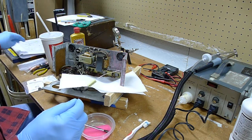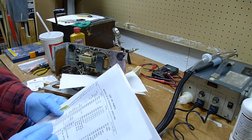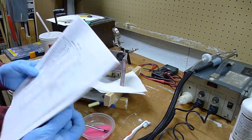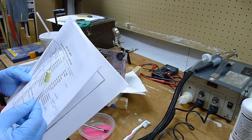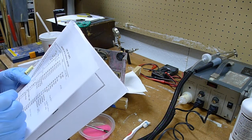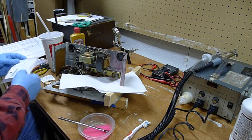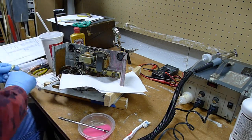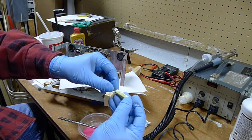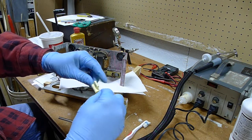It is going to replace two of these. Okay, what am I doing? I only got one. Hold on a minute. Let me think. Just 100 volts. Oh, I know. This one is going to go in parallel with the other, with this one. This is a 2.0 microfarad plus minus 2% 100 volt. And I'm going to put them in parallel like so.